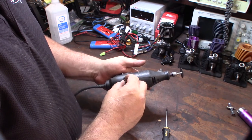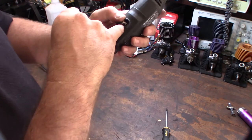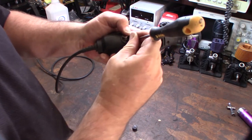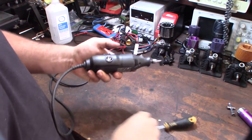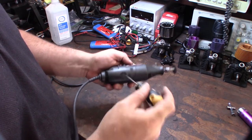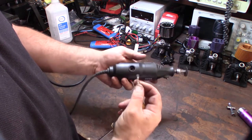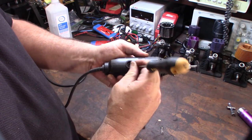Okay, that looks good. Contacts — that's weird, it has that internal contact. It does kind of look a little dark. I'm going to use my screwdriver here to get some of that oxidized stuff off of it right there. Nice and clean. Same thing for the other one. That looks fine. And the Dremel also gets good contact with the brush.